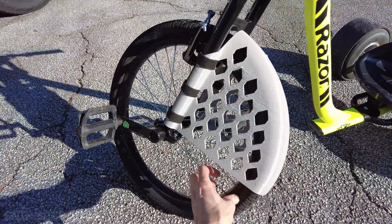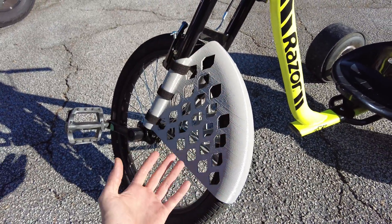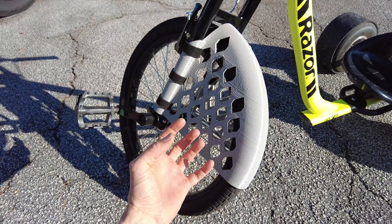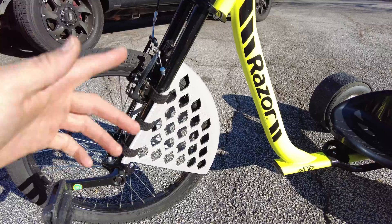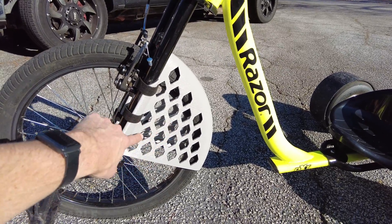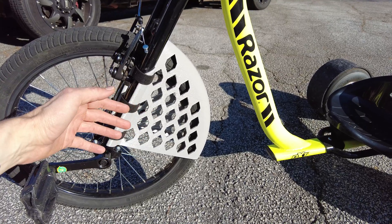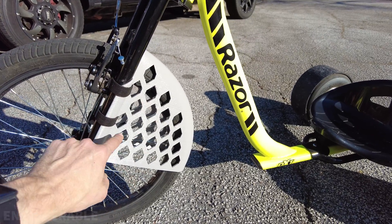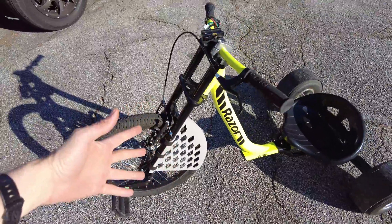What's next? I'm going to improve this design to add more clearance, make it more rigid, and print it in a more rigid material — probably PLA Plus. Because this part is so big I don't want anything that's going to shrink and warp, and PLA Plus is pretty impact resistant so it should be a good material. If you want to make your own fender like this for your Razor drift trike, check the links in the description. I'll provide files in several versions — one requires a large printer with a bed of at least 280 by 280 millimeters, and another version made of smaller pieces you can print and glue together. See you in the next video!